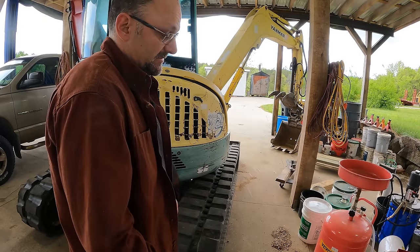All right, I put those lines back. So now what I need to do is flip the two outputs from the two pumps. Now, of course, they're not the same connection. It would be really nice if they were exactly the same, but this one has this thing on it that is basically like a shock absorber for the hydraulic system. It's just going to be a little bit more work, but it won't take too long. We'll get those flipped out.